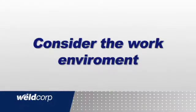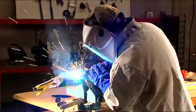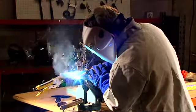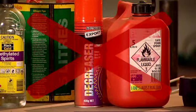Consider the work area environment. Don't expose power equipment to rain. Don't use welders in damp or wet locations. Keep the work area well lit. Don't use welding equipment in the presence of flammable liquids or gases. Welding produces fumes that could be harmful, so always work in a well-ventilated area.